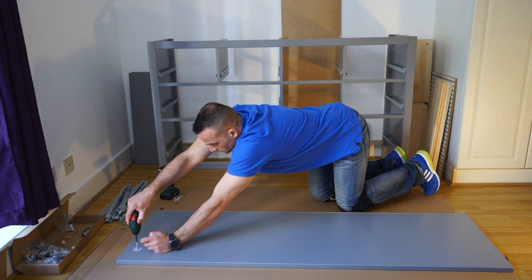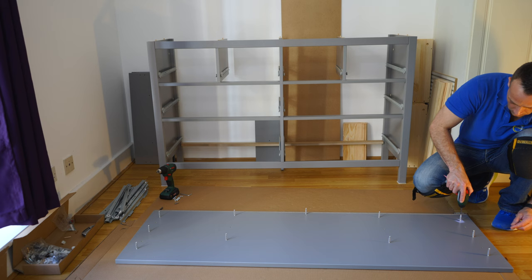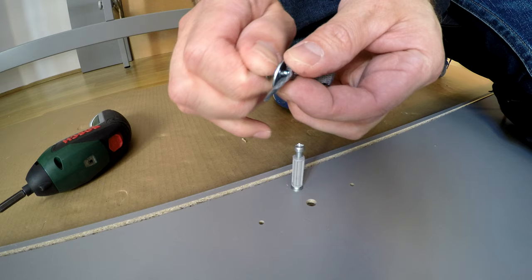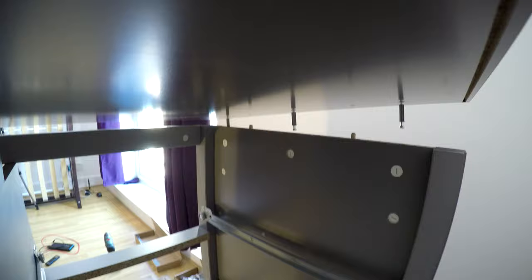Now prepare the panel — three on the side, two screws on the middle, one on the back. Basically everywhere you put the locks they mirror with the panel, so the screws mirror the locks. Don't go deeper, don't go higher — there is a stopper on that screw. There's also a small piece of fabric for securing the unit to the wall — in my opinion very useless compared to what they put in the Malm units.